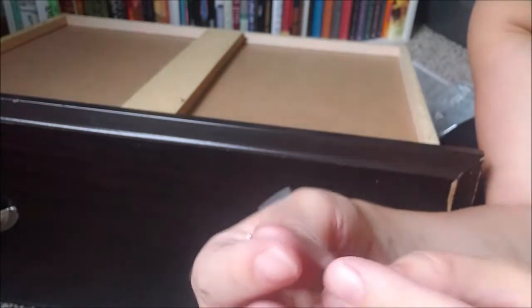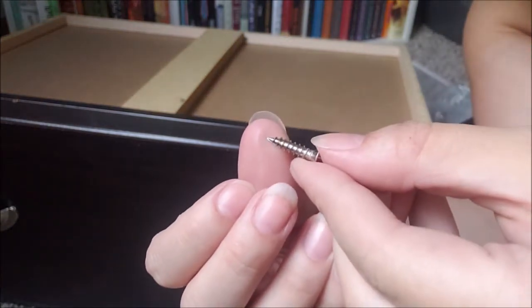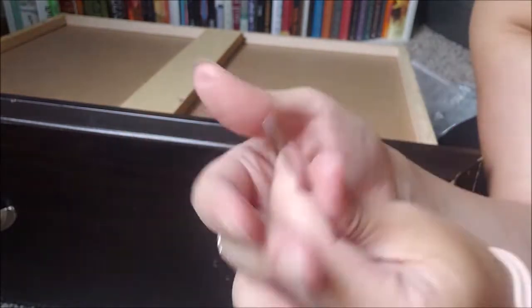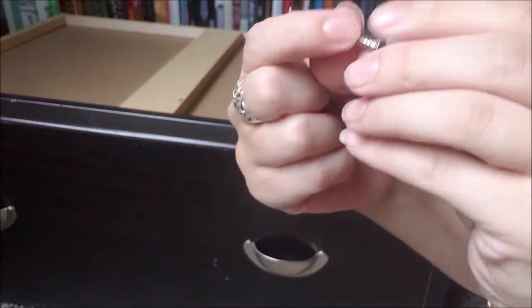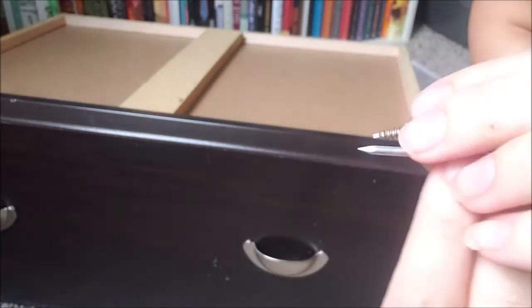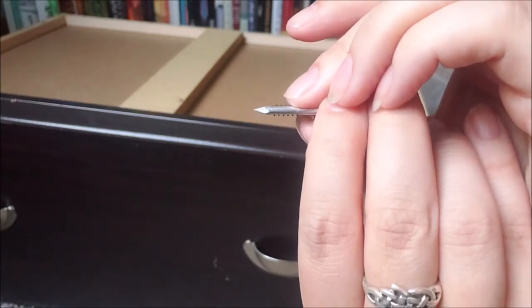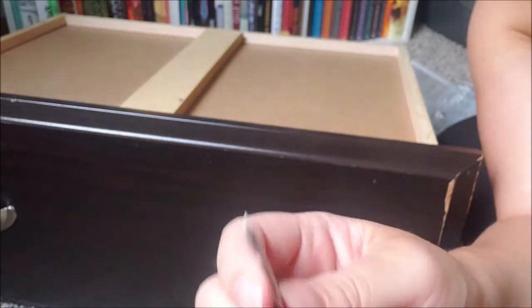And when you swap them around, if you were to put the screw in front, you shouldn't be able to see any of the nail behind it. That's how you know that this is going to be the right size. And the same thing works for the drill bits. Just check to see if you can see those screw treads from behind. So as you can see both on top and bottom there, and that's what you need. So this is the size nail that I'm going to use.